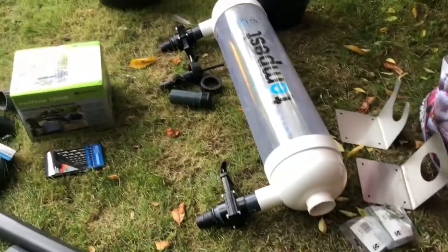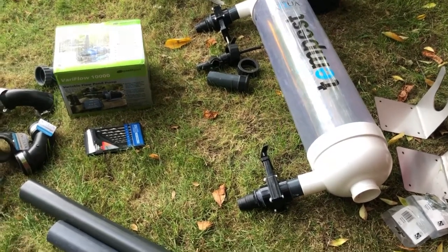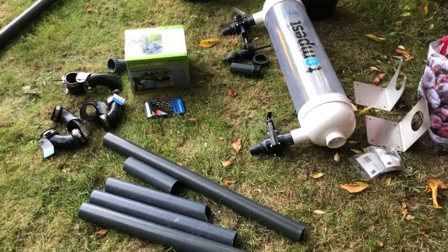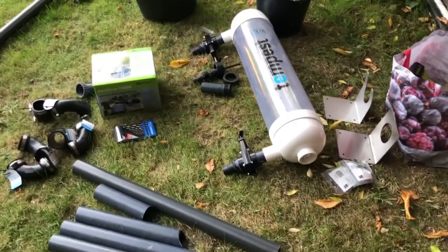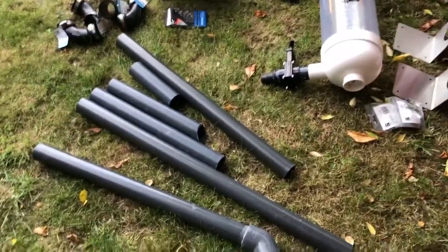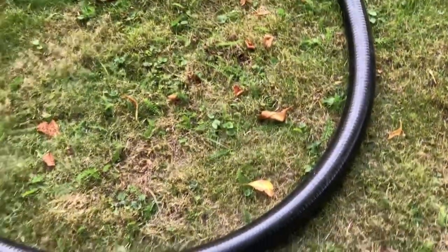I'm having trouble trying to find a way to do it all. What I've read and been told is you can't put dirty water through the heater — it has to be filtered, cleaner really. So I'm going to put a pump in the pond, run that to the Tempest. The Tempest is all one-and-a-half inch pipe, so I'll have to step up from inch-and-a-half to two inch going into the Remora air source pump, then out on two-inch flexi — solid flexi, not the normal ribbed one.